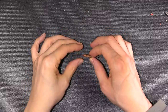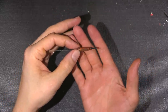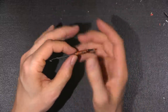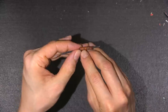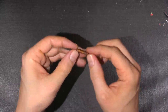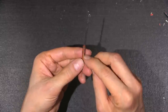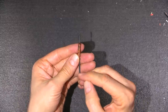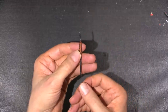I'll share some more capacitor knowledge with you, and this seems to be largely misunderstood by lots of technicians, repairmen, even some engineers, and hobbyists in general. So first of all, this capacitor here is just one of the capacitors out of that radio receiver. I just randomly picked this and pulled it out of the pile. So this is one of those paper and foil capacitors coated in wax. Its rating is 0.003 microfarad or 3000 picofarad. The rating for the voltage is 200 working volts DC. At this end of the capacitor, you can see G, R, and D. That stands for ground. And there's this line here, which indicates the outside foil end. So if this capacitor is used in bypass applications, this side is intended to go to the chassis, as this would shield the capacitor right up to this point, and then you only have a short little bit of lead right here to go to wherever it needs to be going.